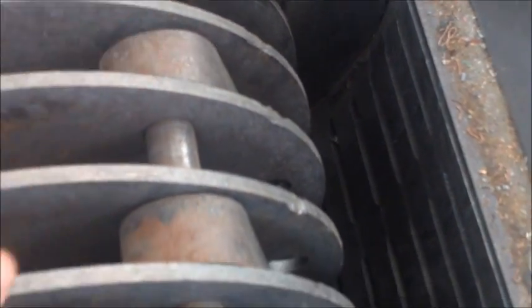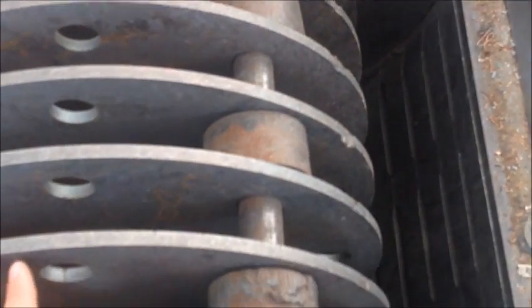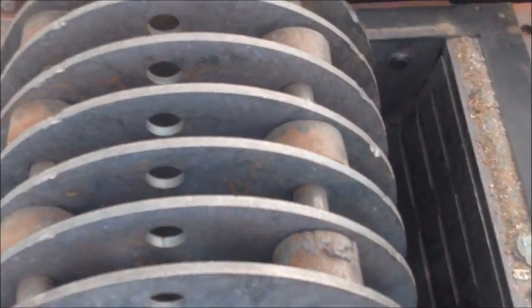are just on pins there. And for our ore grinding hammer mills, we have hammers on every slot all the way across. But for boards and our recycling stuff, we found that you don't need that many hammers, especially if it only needs to go through that half-inch slot there instead of a real fine screen.